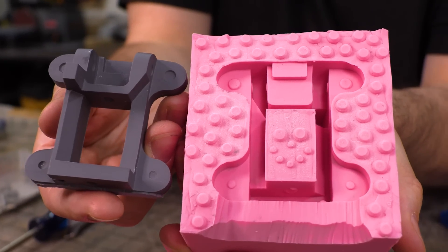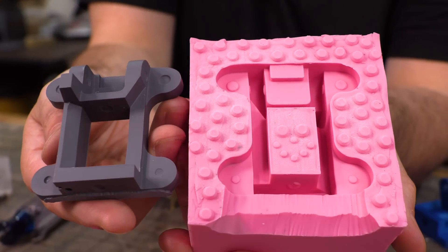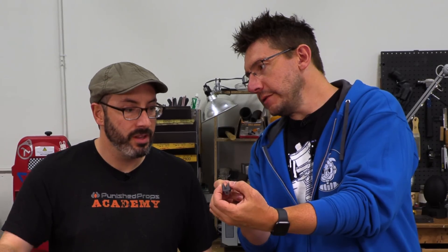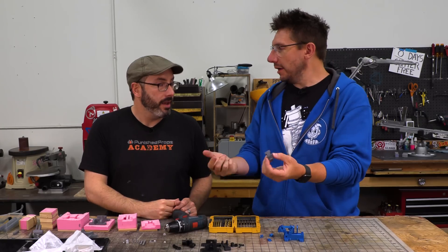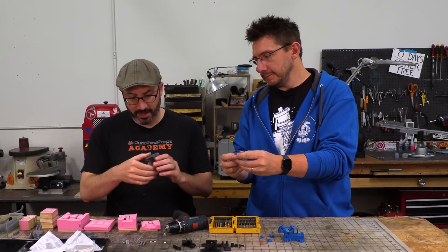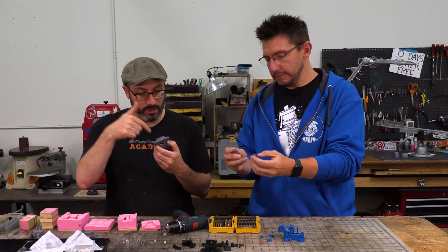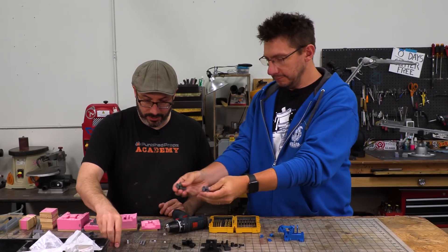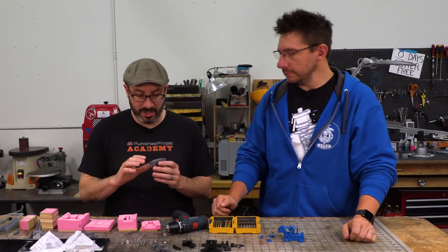This can take drilling — it's a urethane resin, which is much more impact-resistant than the Form 2 resin. It's got a little give, a little flex to it, so that's why it can take an impact. Some holes need to be tapped, so Bill can go in there, drill it out, and tap it with his taps. He's got all the hardware too, so he'll clean these parts up — they need a little bit of sanding to get rid of the sprue and fill a small bubble. Then he can paint them and assemble with all the hardware.